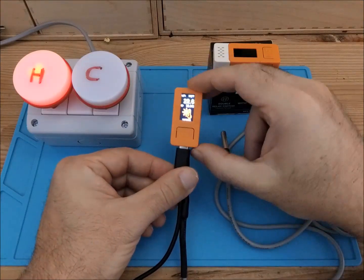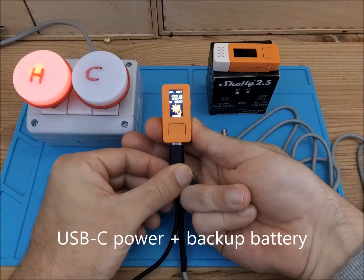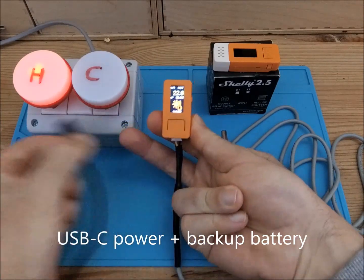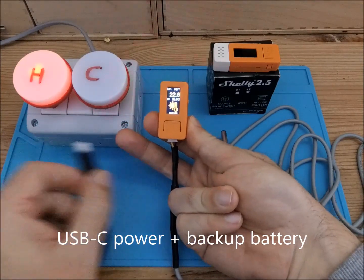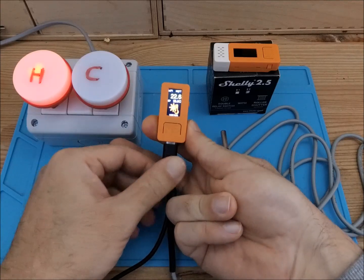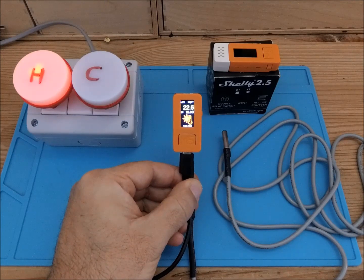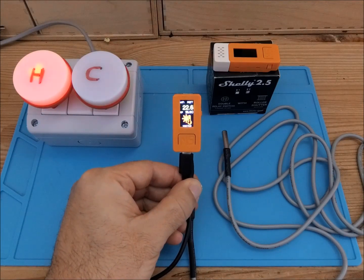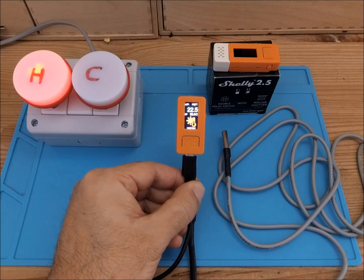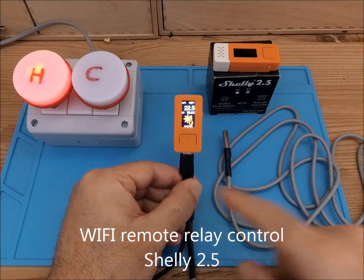Power is provided by a USB Type-C connector, but there is also an internal small backup battery so in case the power fails you don't lose your process. The other main characteristic is that the control unit is completely standalone — you can add probes and run your process while the relay and the power part are completely separated.